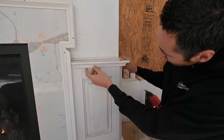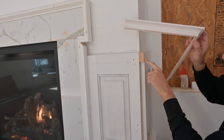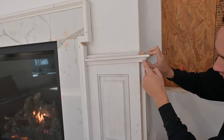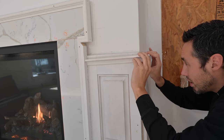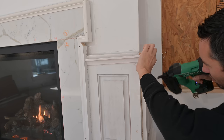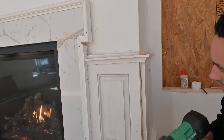There we go — our nice pre-assembled piece, we can just install it as such. The most important thing here is that this is level with my line, and we know the block we put in is level with my line. I have a line on this side as well for reference. So all I have to do is get it flush with my block at the end, shoot it there, and then pivot off this and find my pencil line over there. I'm going to use 18-gauge brads for this — it's a small molding and I don't need to blow through it with a big 15-gauge.